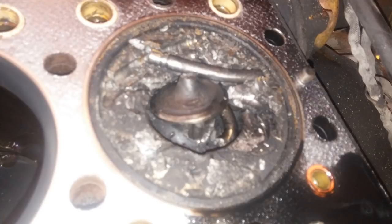The reason you would be replacing bearings before an engine overhaul is to prevent them becoming very damaged. This is a connecting rod bearing, and it's heavily damaged — this is called a spun bearing, meaning the friction got so bad that it stuck to the crankshaft journal instead of the connecting rod, and it actually spun with the crank. At that point, you're basically destroying the crankshaft, the engine, and or the connecting rod. Usually when you see a catastrophic failure like that, it's because something has failed in the oil system, or perhaps you've had a cylinder failure like a dropped valve which forced the connecting rod into the crankshaft. Generally, light bearing wear is not going to cause a spun bearing.